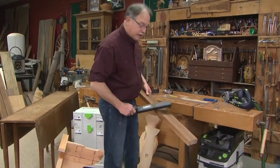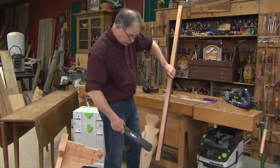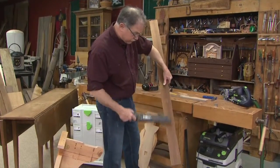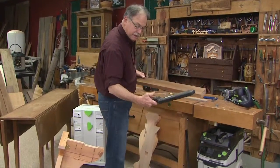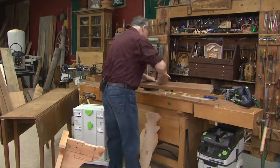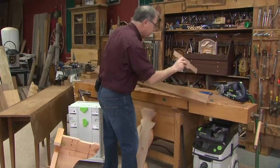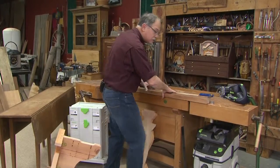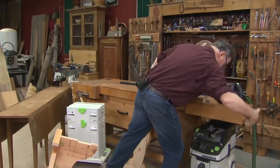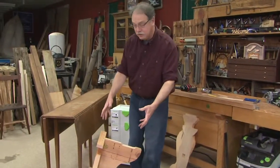Today we're upcycling wood — in this case southern yellow pine that's quarter sawn, straight grain, no cathedral arches, straight all the way around. It's been checked for metal, and this is one handy tool right here. It's clear, and I've got the tenon laid out here. We'll dog that between the bench dogs and take a look at the table parts as they are pre-fixed here.